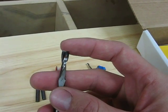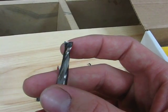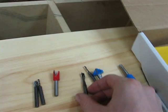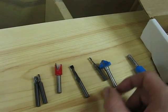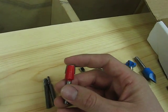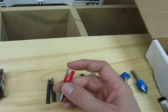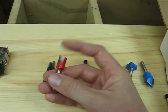I cut out a bunch of patterns a couple weeks ago and it really kind of blackened the end of the bit and actually chipped one of the cutting edges. I don't know if it's just hardboard or if that brand bit doesn't work well in hardboard. Another flat cutter I use quite often is a half inch, and I'll use this as a large area clearance tool in pockets and things like that. This just works great — you can hog off a whole lot of material.